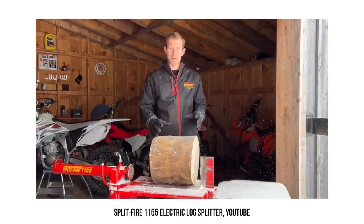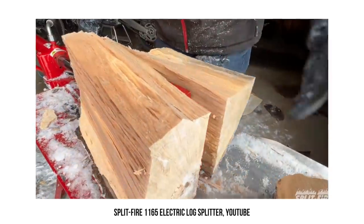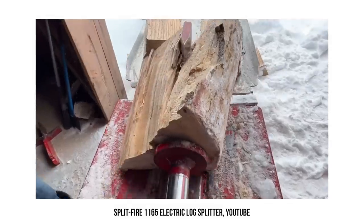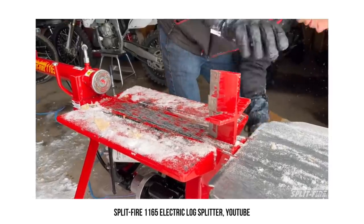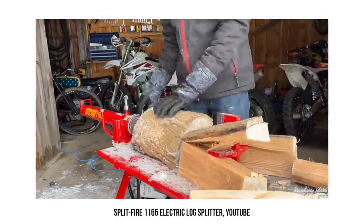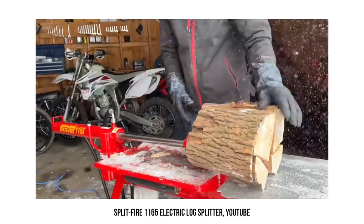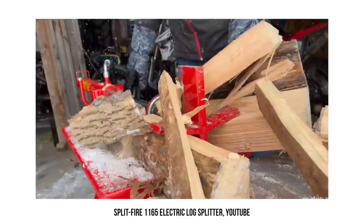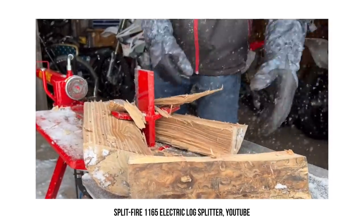This 1165 is kitted with the electric motor option. Besides the low maintenance on a unit like this, there's less noise, less vibration, and you don't have to worry about poisoning yourself. On a snowy day like this, you can put it in the shed — you can put it in a basement and split to your heart's content. The machine has the same power as with a gasoline engine. The only difference is they put a slightly smaller pump on it so that it can be managed by a regular 15 amp breaker, which means instead of a four second cycle time it's now a six second cycle time. We are actually a Splitfire dealer, so if you want more information, we'll post some on the website — we're happy to get you a quote and submit your order.